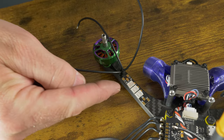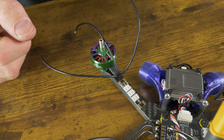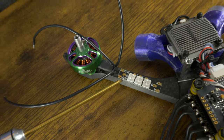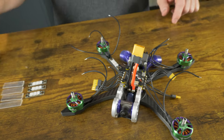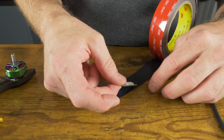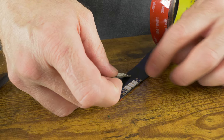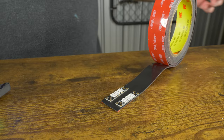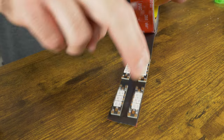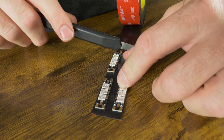In some race wire configurations the diode facing the other direction won't work, so always face the diode towards the motor so the flow of electrons goes the right direction. Get the race wire in position, put the tape on the table upside down, and cut around it with a razor blade — it'll be the right shape. This tape is activated by pressure so push them down hard. Don't do this on your mom's kitchen table — you'll get yelled at.